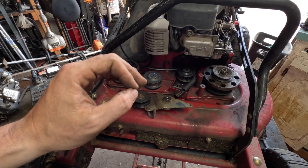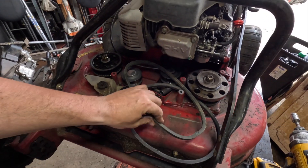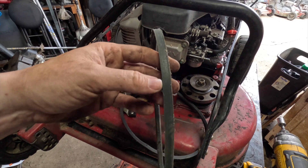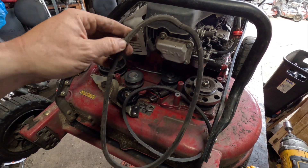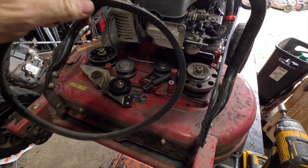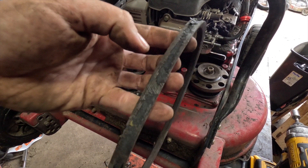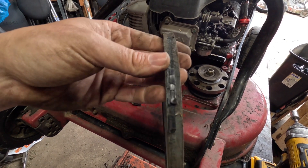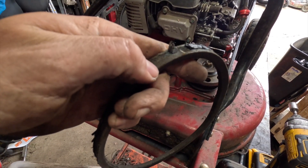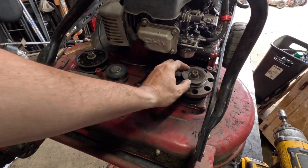Stay tuned to the end - I'm going to show you something else that occurred with tightening a belt too tight. More likely than not you already know this, but you're going to be chewing through belts. This is one off of the machine - same owner, same mechanic - and over-tightening it is chewing up belts. You can literally see how this belt is getting toasted, and it's been rubbing against sharp plastic. The belt shouldn't look like that.